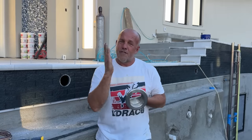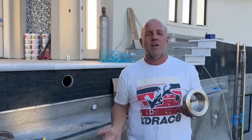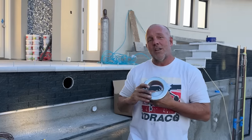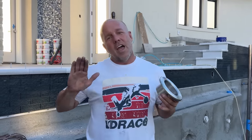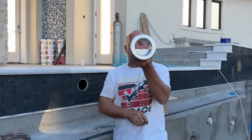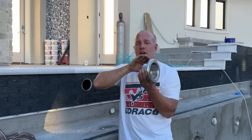Now normally on a pool you have a flapper door that goes up and down with the pool level, so if there's evaporation or you're changing the level of the pool between when the auto fill brings it back up, it's always skimming perfectly. This one, that autofill system works way down underground on the part of the pool that is 2 giant tanks, one for the pool, one for the hot tub, so that all the lines in this pool can auto drain if the power went out and winterize itself. Everything downhill slopes. So I don't need a skimmer door, I just need a fixed water line. And when the pumps turn on, they'll overfill over this and it will always waterfall.